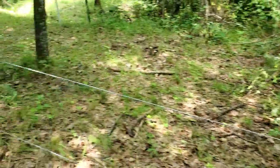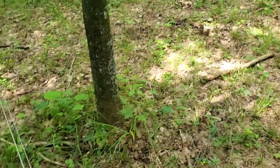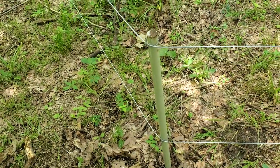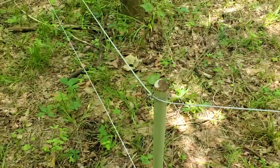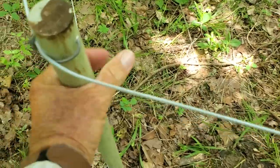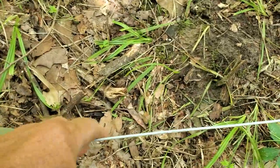There's another one of those corners. We're going to have some two-and-a-half-inch foam-filled posts — hoping to have those in within the next couple months. That one right there is an eight-footer, driven in the ground five feet. There is some tension on there — I mean it's just like a tree. Feel that wire — it's a darn good looking fence.